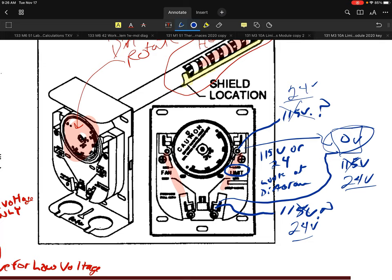I typically try to figure out what I'm dealing with as a circuit to identify: is the voltage here or is it not? I find that way more valuable than just looking for zero volts, because zero volts could mean there's no power to this. On the fan side, you're going to troubleshoot it the same as you do on the limit side. The only difference is you're now focusing your efforts on the fan side, and you're asking: do I have voltage at this point?